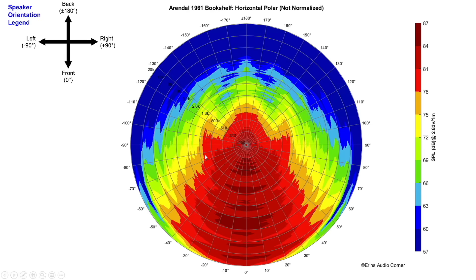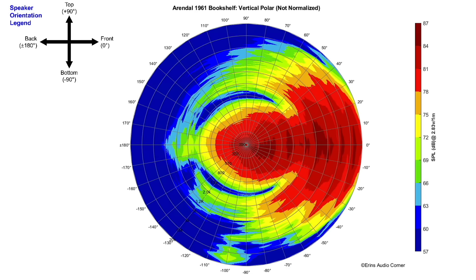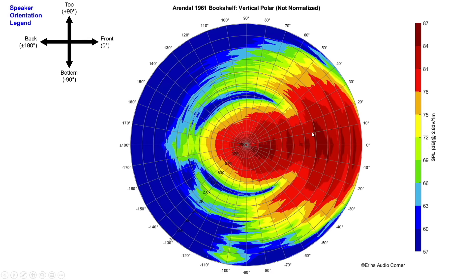Now we're talking about the horizontal off-axis radiation pattern. This is a pretty constant directivity design, trending toward about plus or minus 40 degrees in the high frequency. On the low frequency it's about as wide as 90 degrees, but if we go out to about 1.3 kilohertz where it starts to narrow up in response, we're at about plus or minus 70 degrees. The vertical response is pretty good, though we can see some narrowing in the mid-woofer mid-range region, and then when we get to the tweeter it goes wider. That's a function of having two drivers spaced separately on the Y-axis — unless it's a coaxial driver, you'll usually see something similar. For this speaker, this actually looks pretty good, and I like that above and below the speaker is pretty symmetrical.